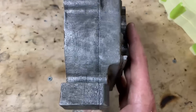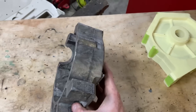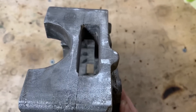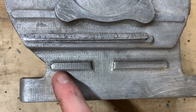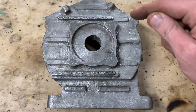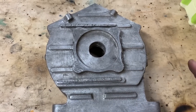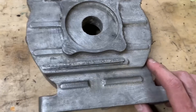The top side — this is the side that had no defects, as it was poured in this orientation — bugger all in the way of defects. It would have had a nice tight layer of sand up against it and it came out quite good. All of these little lines are caused by the mill doing its parallel toolpath, stepping over one millimeter every time. Easy thing about that — it's really easy to program. It does take a little while but you get a nice radius on everything, and that is what we're going for — a nice radius to make a strong part.